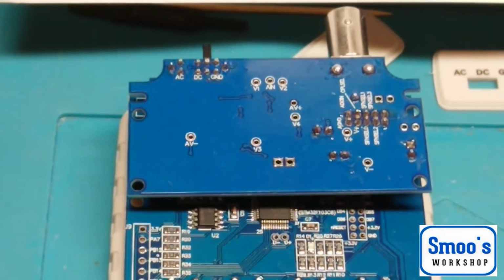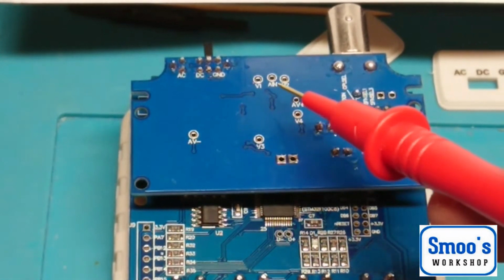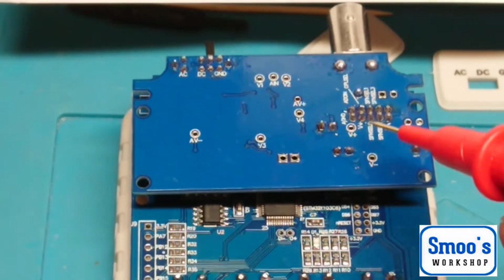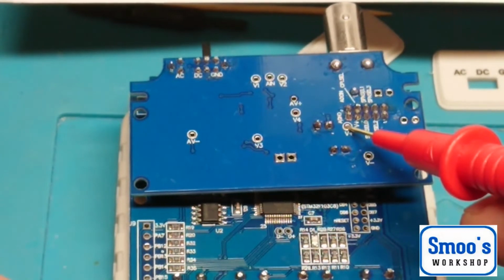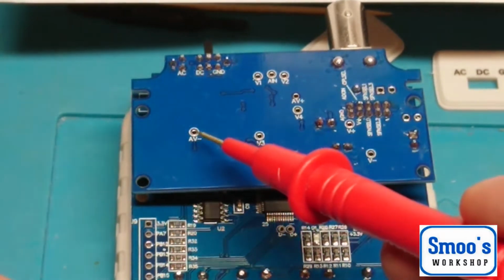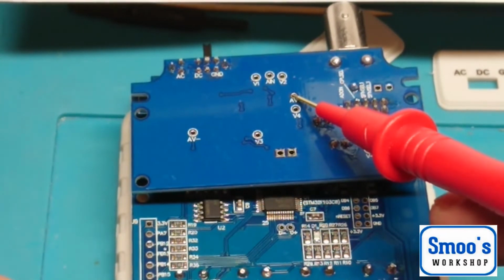the first one it's asking you is V plus, which should be around about 8.35 volts. So where's the V plus? Ooh, there's V minus. Where's V plus? Is it up here? There's V plus. So if I go into V plus, I should be looking at around about 8.35 volts. It's sitting at about 9.2. But it is saying that this measurement's applicable for a certain version of PCB, so right, 9 volts, okay. AV plus, there's AV minus, there's AV plus, should be sitting at 5 volts plus or minus 2%.